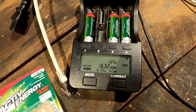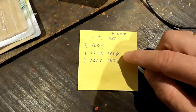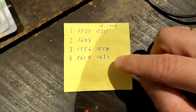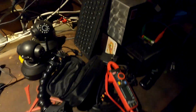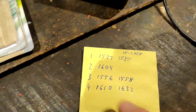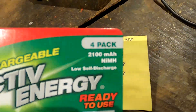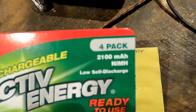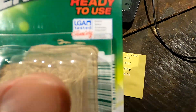This is the second round of measuring the capacities of these batteries. I've written this down and it's fairly consistent with the first round. I also took battery number two and put it in my other tester, which is already done, and we got 1526 milliampere hours out of it - a little bit less than before. Nevertheless, clearly these batteries don't have 2100 milliampere hours.